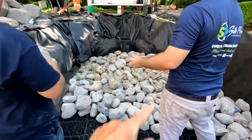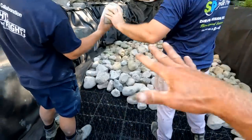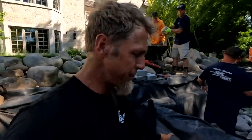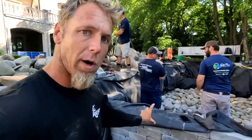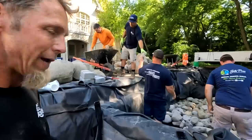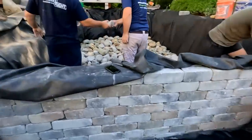There's the snorkel back there. This is our wetland filter. This is the liver for the system. The reason we put this wall in here is because after digging conditions, rather than trying to build a ledge or a wall inside and then come back down and eating up all that extra liner, we had some extra scrap liner. What we did is we put the brick wall in.